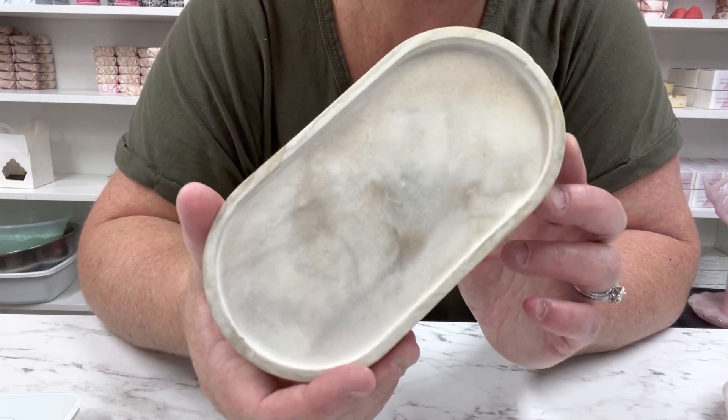So I've got two of these moulds. With this new product, pretty much all you do is add water — you need to get the powder soaking in the water. From what I've read, you do need to measure everything. Some cements you can just pour and slowly add water until you get the pancake-mixture consistency, but for this one it says you must use the right amount of water, otherwise the product's integrity won't be good and it may not be strong enough. I've also ordered some new candle moulds from Lee Moulds in Australia, but for today let's give this a go.